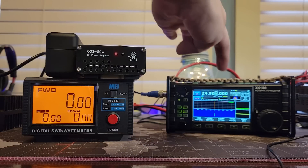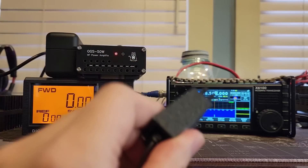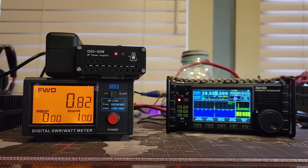21 megahertz: 20. 24 megahertz didn't do so hot - we doubled our power, going from 5 to 9.8. 28 megahertz: same thing. There is a relay inside of this unit that clicks on when there's RF going through the line and then clicks off when you're done. I am in straight key mode on my paddle - it doesn't switch off fast enough for full break-in, which is nice because you don't want to hear the clackity clackity clack. You can see on the oscilloscope it clicks in fairly fast and clicks out a little slower. That's working pretty well for that purpose.